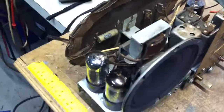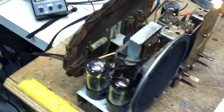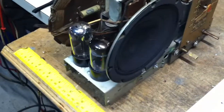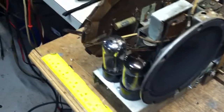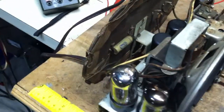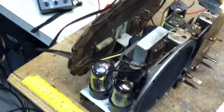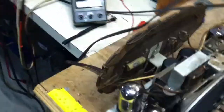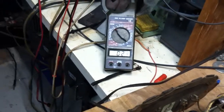This radio was interesting. It had a defective break in the speaker coil in its dynamic speaker. That was interesting because I had to cut into the speaker to do the repairs on it. You just can't go out and easily buy and replace a dynamic speaker. It all came out well — I had to repair the speaker, and now it does a good job.